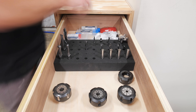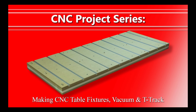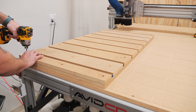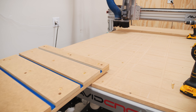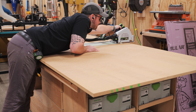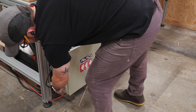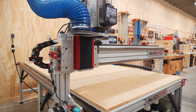Next was building the T-Track fixturing table, which was inspired by a similar table built by LegacyCNC. I made my own version starting in Aspire just to figure out all of the toolpaths. This table mounts on top of the MDF spoilboard using threaded inserts and has replaceable strips on top of a base panel so I can change out any damaged strips in the future. I first cut down a few pieces of MDF with the track saw and table saw, then loaded up the first G-code file which would cut the holes for the threaded inserts in the spoilboard, and homed the machine before installing the first bit.